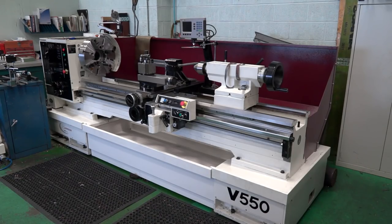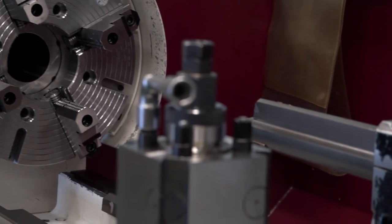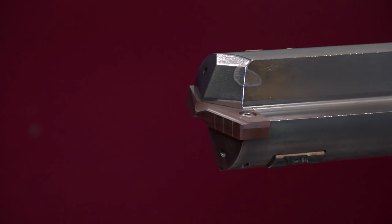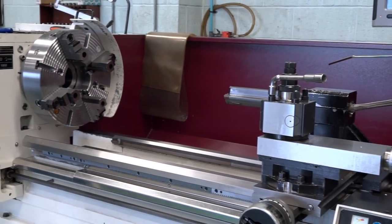One final point - the Harrison machine, also available from Colchester Machine Tools. They supplied you with a V550 last year. What was the purpose behind that purchase? On that particular machine we do drilling. I bought an actual drill attachment from Colchester Harrison which goes to the centre of the saddle, so I'm getting equal amounts of pressure for drilling and finishing. You get no wander on the tool - absolutely, and I can hold 0.05mm tolerance with a spade drill.